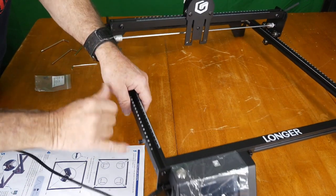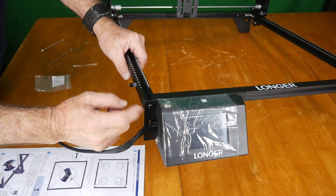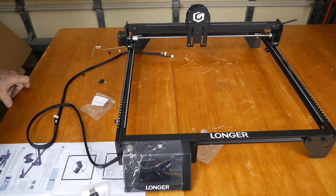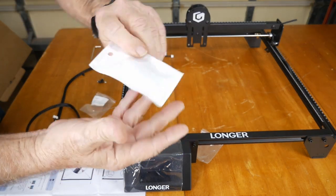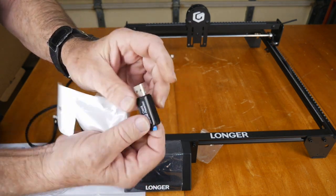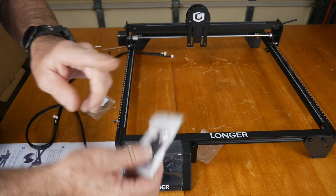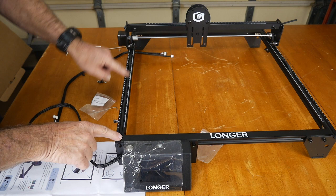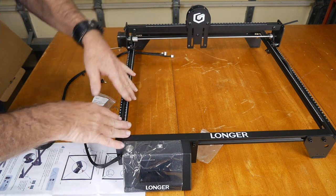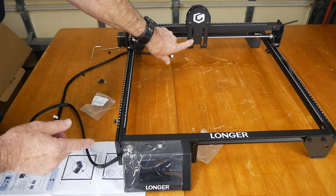One screw in the package is a stop screw with a plastic washer sleeve that stops on the side, one short cap screw goes on one end, and a regular allen-head screw goes on the other end. For Step 4, this machine comes with a USB plug with a TF card in the back — like a little adapter — and inside are the instructions. You really need to look at this because the drive belts have to be installed in a specific manner. You have to put the belts in and set your timing on the rod. Then Step 5 is mounting the actual laser.